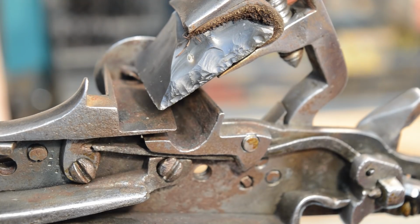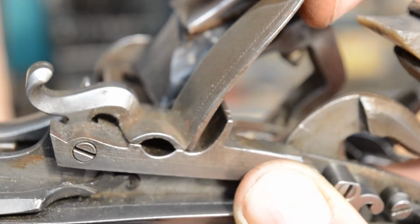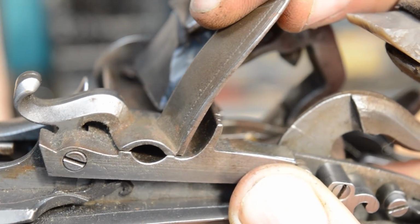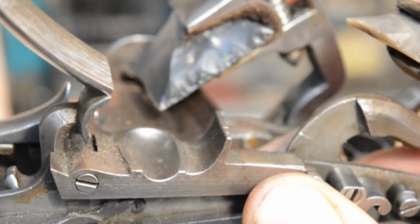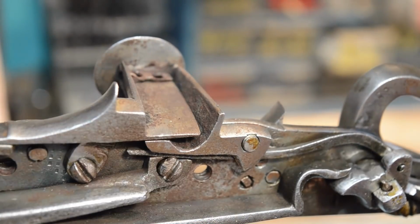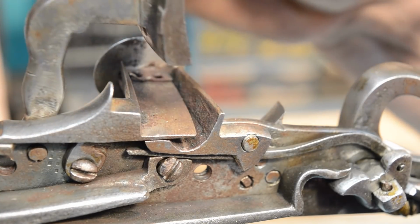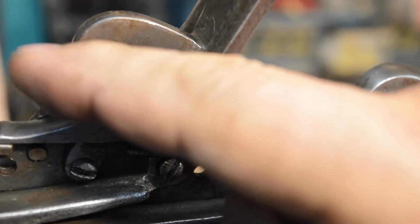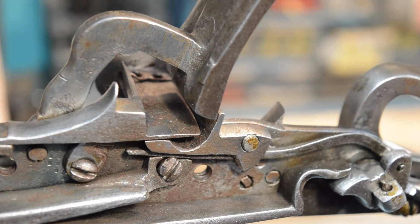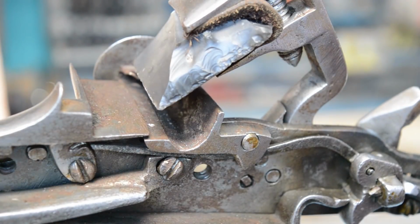In a Flintlock, that same evolution, give me a little bit of an uptight on the focus here. Thank you. That same evolution, the pan cover and the part that makes the sparks is integrated, as opposed to on a Snaphaunce, where you cock, you snap it back, and then you bring the frizzen down like that. So the frizzen is independent on a Snaphaunce, and the pan cover is mechanical like it was on the wheel lock that preceded it. So if we kill this, kill that, then we can make some sparks, you see.